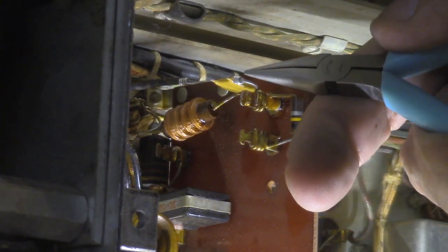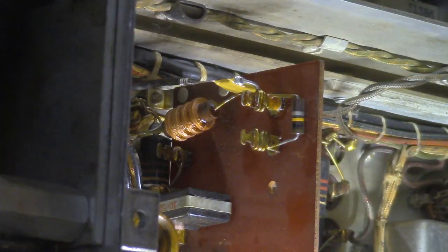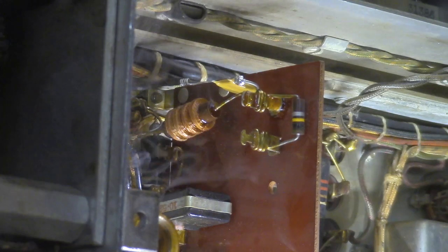Right here is where that little coil is, and then down here. So we just take the soldering iron and you just hit that coil. You watch that for it to kind of solder and sweat into that connection. The other thing you can do is hit the old wire while you're heating the coil, and it'll wick right in there. When you do it right, it'll just flow right in there and it'll look like a million dollars.